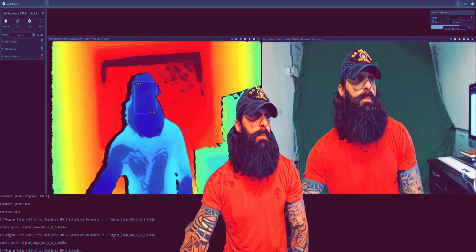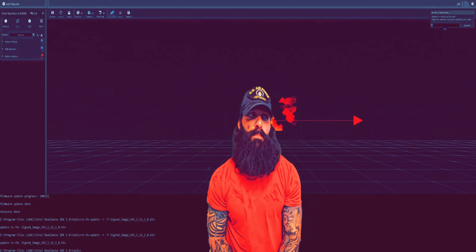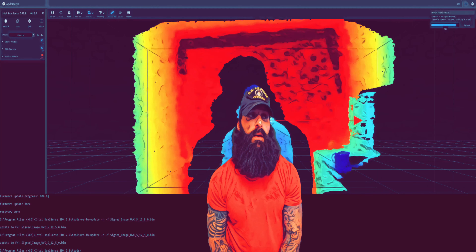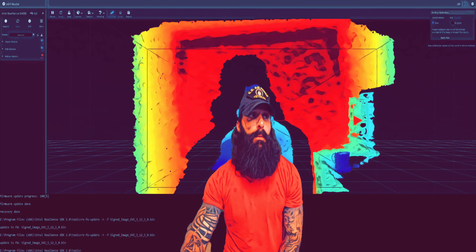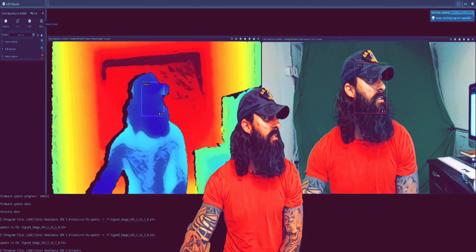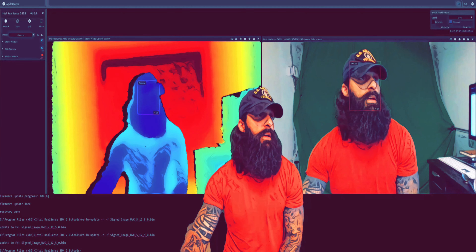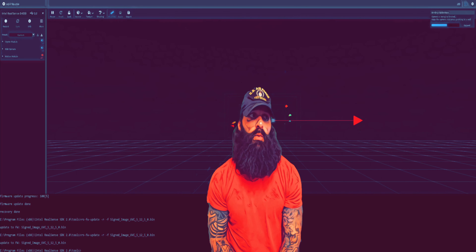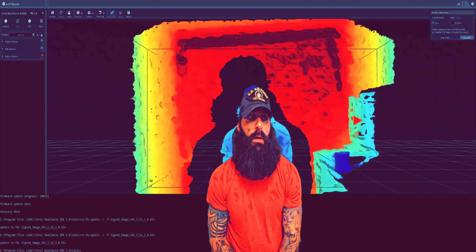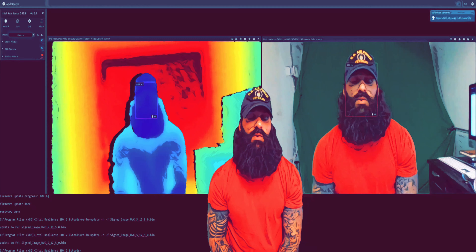We'll do a slow speed intrinsic calibration first — this is for the vertical cavity surface emitting laser matrix and the infrared dot matrix. I'll stay very still. It starts from zero percent, goes up to 100, then gives a health indicator. It came back at 0.2, so I'm going to apply that. Now let's do the extrinsic calibration to calibrate the left and right stereo imagers. You want to point this at a white wall and keep it stationary, but the calibration tends to come out pretty good even while pointing at me.